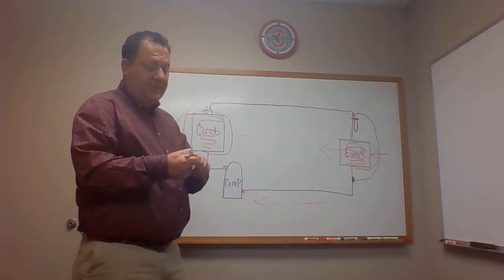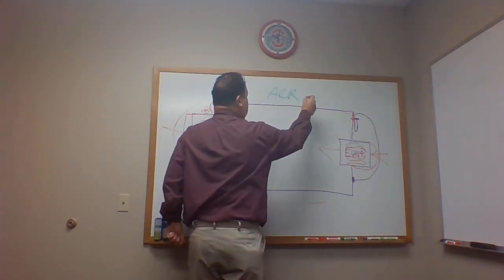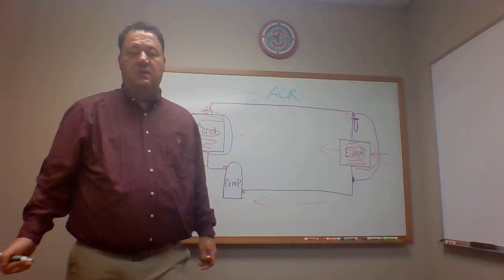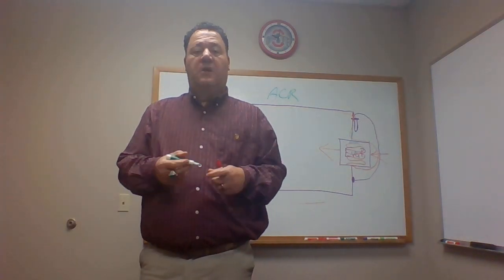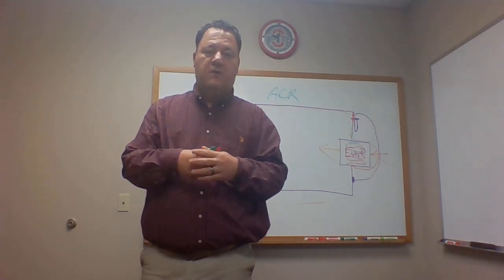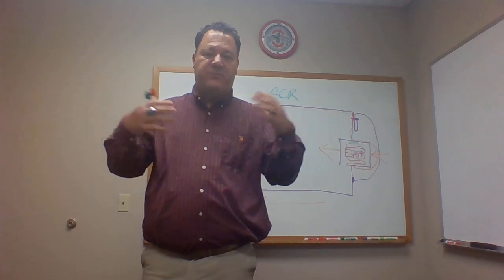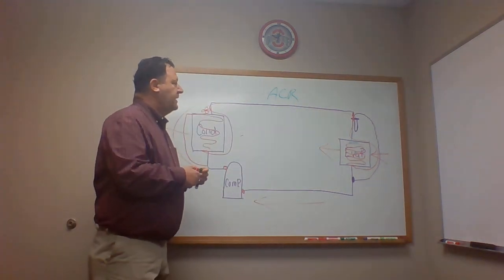We use ACR tubing in refrigeration. It's dehydrated, it's seamless, it's measured in OD, okay? So don't just be grabbing fittings out of the big box stores, especially those short curves. We can't have any of that. We get a pressure drop, especially on our suction side, but anywhere, our suction side, all right.